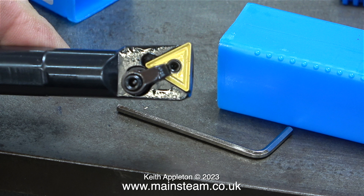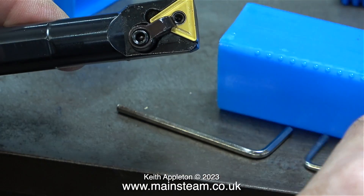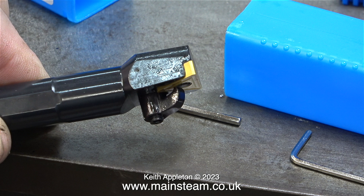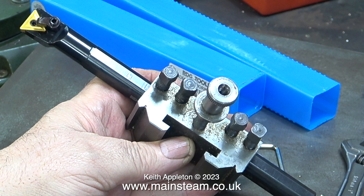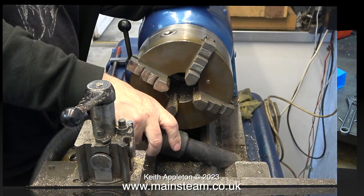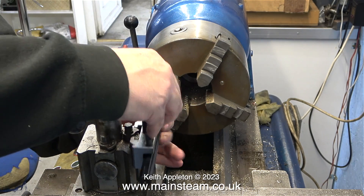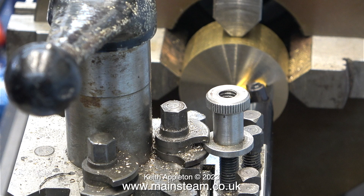These take triangular tips, but you can turn them over. This tool comes with a couple of Allen keys — one for the clamp that holds the tip in place, and another to remove the register where the tip fits. The boring tool came with the tip already fitted, so it's a simple job to fit this into a tool holder, which will be exclusively for use in the Smart & Brown lathe. This will be great for boring cylinders. After machining that piece of brass bar at too high a speed, there was a lot of brass swarf everywhere. I'm not going to do much machine cleaning because I don't want to stick any pieces of swarf in my person, but after the MRI scan on Friday I can clean the workshop.